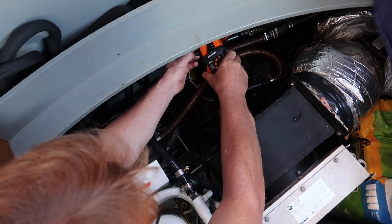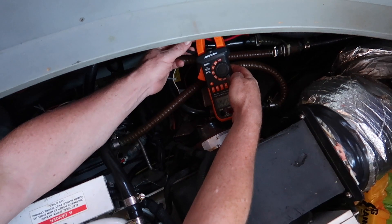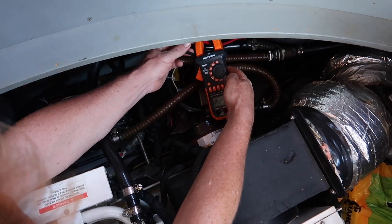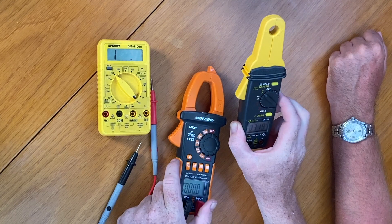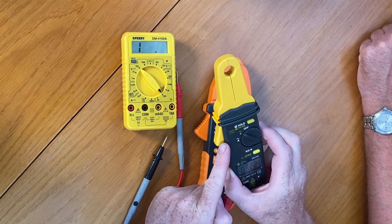This specialized meter is extremely sensitive — I use it for testing DC leakage current on boats, which is part of a corrosion test. This more rugged one is what I use most days. For people just getting started, I recommend something like this — it's kind of a middle-of-the-road meter. There are fancy high-end ones and there are much cheaper ones — this low-end one here, and you can also get very cheap analog ones. I recommend going digital because that allows you to do a few more tests.